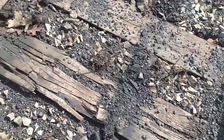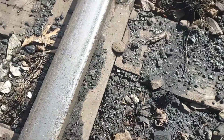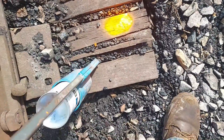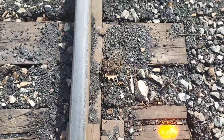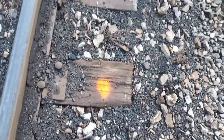Here's a really bad one. See how it's all splitting out there? Spikes not holding. There's no danger of the gauge spreading because I've got good spikes over here and good spikes over here. But we're going to replace this because it's under a joint and it's all boogered up, and I don't like it. See how this is split out really bad? The water just pours down in there. That's no good — there's not much there holding that spike either.